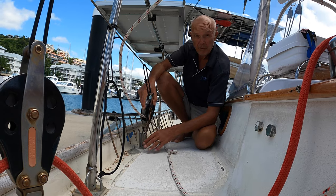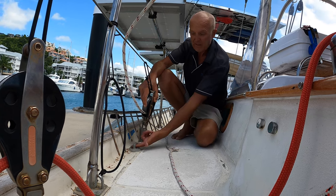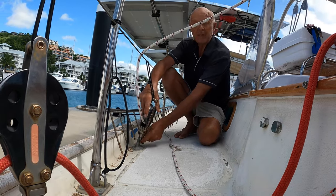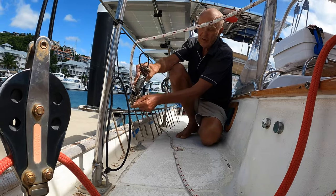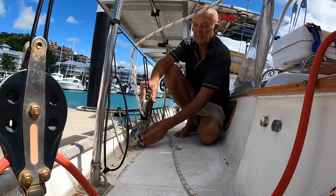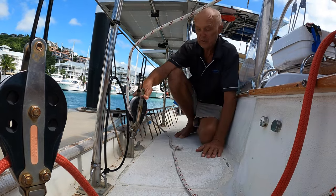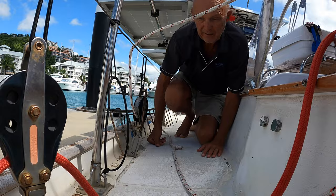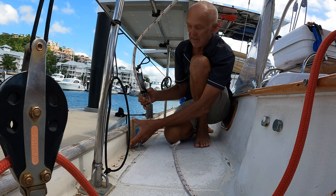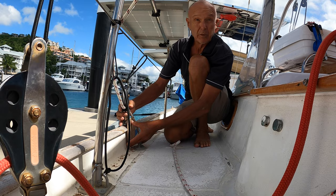While we're at it, we'll remove any obsolete deck fittings. This big heavy-duty pad eye was the fitting for the running backstay — someone moved it out to the track so the backstay clears the deck better. That's coming off and the bolt holes will be sealed with epoxy — no chance of leaking. The running backstay turning block will have its own chain plate right there.